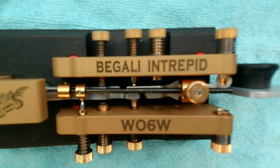Once you have your dot weight set, there are a number of ways to confirm it. Ideally, your ear knows the sound of the dots you want. The traditional method has been to put a moving-coil ohmmeter across the contacts and adjust for roughly 50% of full scale — slightly heavier dots move toward zero ohms, slightly lighter dots toward infinite ohms. Modern computer programs like CW Fist Check provide a graphical presentation of dot length. You can also use programs such as Audacity to record your side tone and examine them that way.